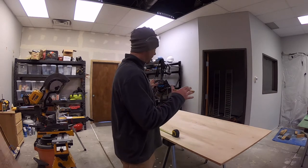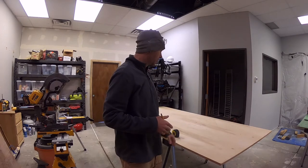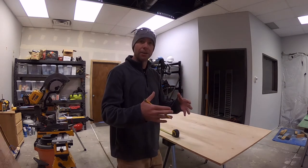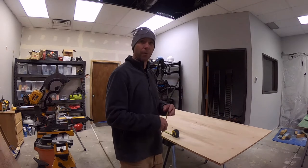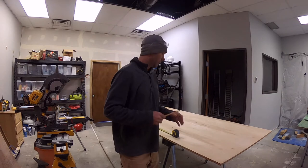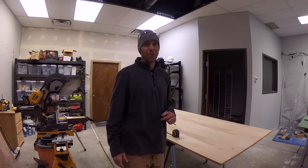And I'm gonna go ahead and cut the cross cut first, which is basically going across the grain of that piece of sanded birch. And once I cut it at my length of 84 inches, I'm then gonna take everything I need and set it up in front of that table saw. I'm gonna rip that down to 27 inches, and then we'll be ready to basically prep this thing and start putting that red oak on there after I source all the nails. And there's a lot of them, so maybe I can recruit some of the kids to help me out. But that's what I'm going for first. So I'm gonna go ahead and cut this thing. I'm gonna move everything over to the table saw side. We're gonna rip it, and then we'll see how this goes.